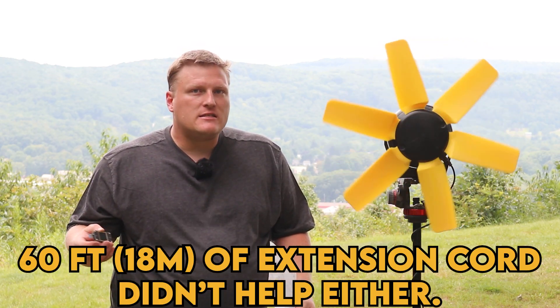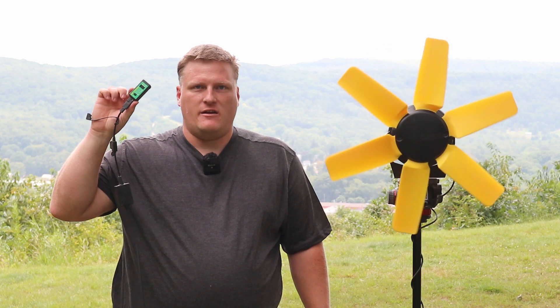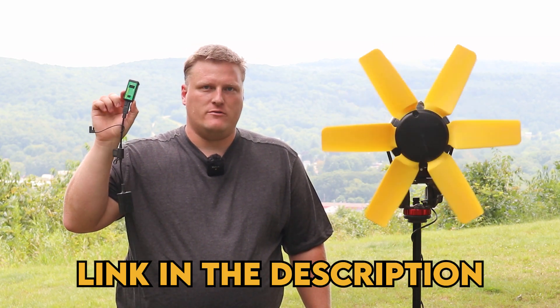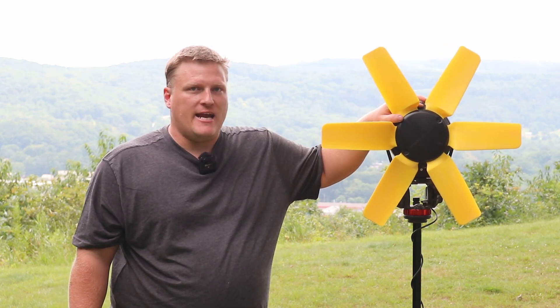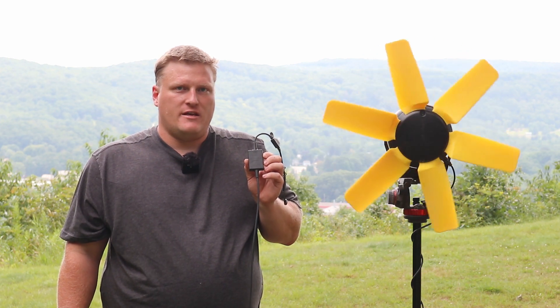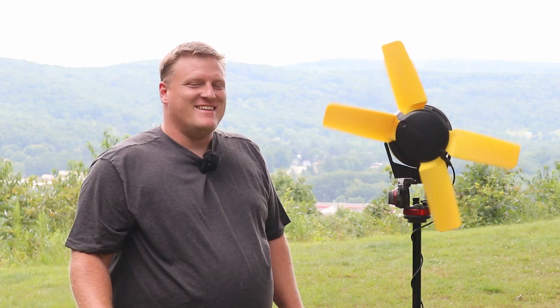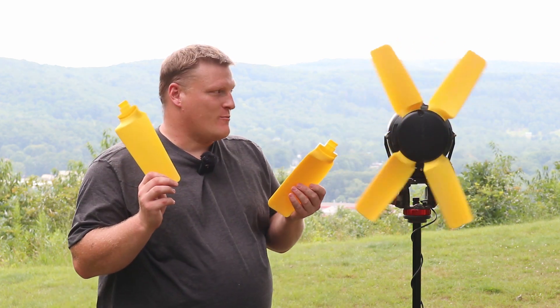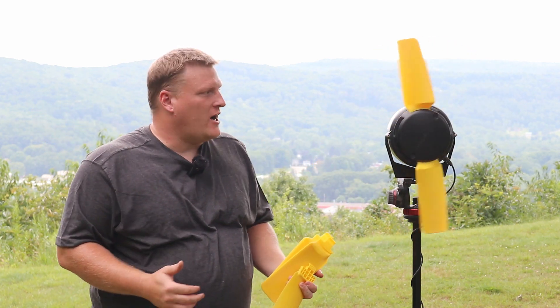You can still use USB with the 12-volt version — you just need an adapter like those used on motorcycles. One thing you might have noticed: this thing is super quiet; often the wind noise on my ears will be louder than the noise it puts off. It produces up to 80 volts of three-phase AC, which it rectifies and limits to 14.5 volts. There is a brake that comes on at 80 volts AC, but they recommend not leaving it free-spinning if there's no load on it. The engineer also mentioned you can take off blades to run it as a three-blade or two-blade propeller — this would be better for higher wind speed applications.